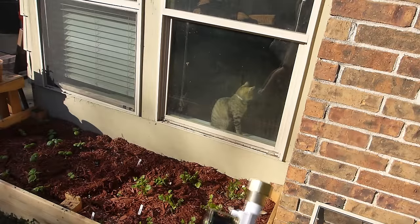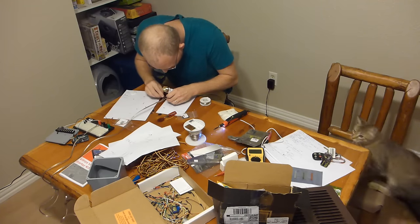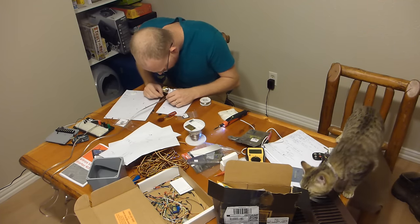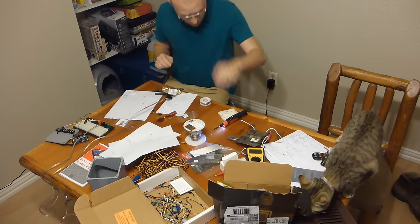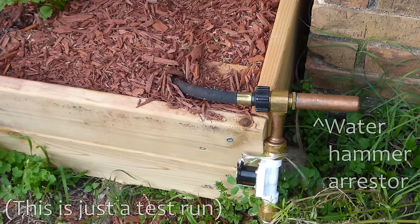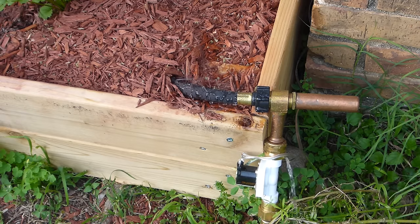For the actual watering of the garden, I've got a cheapo solenoid valve from Adafruit. I built a little circuit with a transistor which allows the Arduino to switch the valve on. Right now I have the code check the water level once a day in the evening, and switch on a soaker hose for a set amount of time if it's below a certain threshold. From what I've read, it's actually better for the plants, and herbs especially, to have some cyclical nature to the wetness and dryness of the soil, rather than just being constantly well watered. This scheme also reduces the duty cycle on the valve, and if a sensor goes bad, there's no chance of flooding the yard.